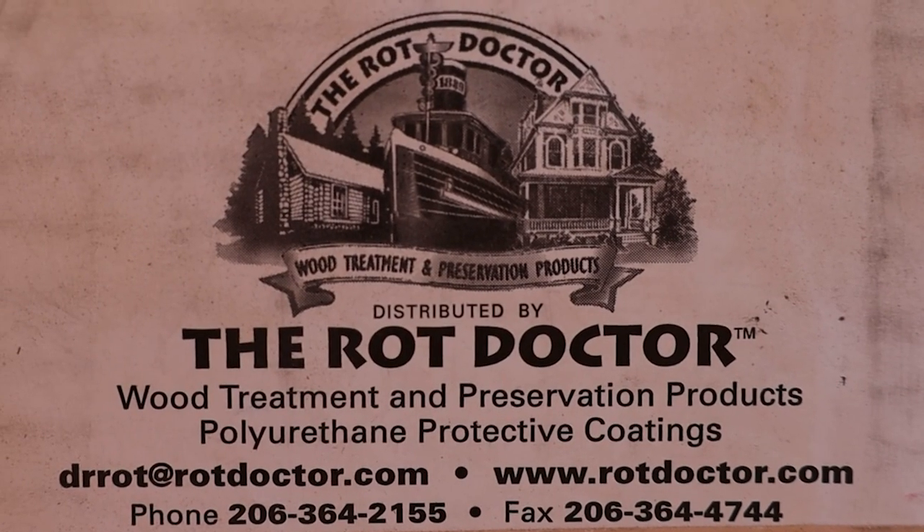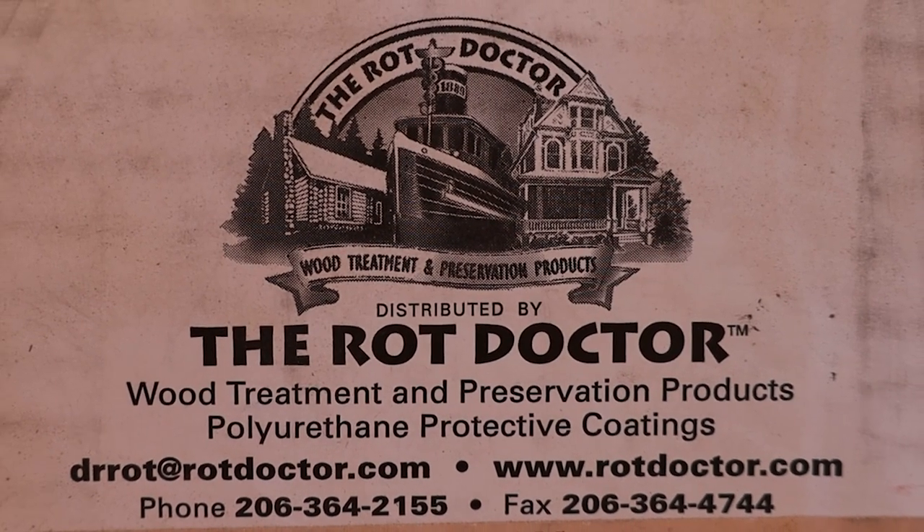To do that I'm going to use a little bit of penetrating epoxy. This is a Rot Doctor product — I think other people make similar products. This is almost like water, but it seeps into any place there's a little bit of rot, seals it up, stops the rot, and helps protect the logs long term. There's actually a three-step process. The next one is a little bit thicker and can be used to fill some cracks and things like that. Then finally there's one that's more like Bondo. I've never had to resort to it for any projects, but the penetrating epoxy seems to do a pretty good job.